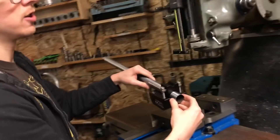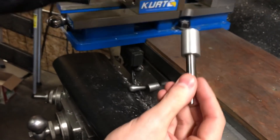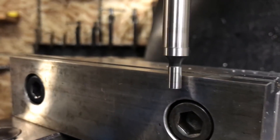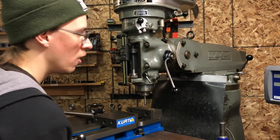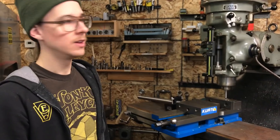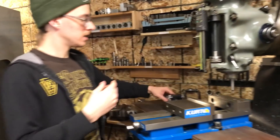If I put it in my machine, I can establish the centerline a couple of ways. My favorite way is to use an edge finder before I load the tube in. Edge finders are real cheap and you can get them for any sort of milling machine. The idea is it lets you establish where this face is in the Y-axis and you can zero off that. When you turn it on it's wiggling around, and as you draw it closer to the edge, it kicks off to the side because of the friction on the tip. Then if you move over point one, you're right above that plane. So now that I have zero established as this back face, all I've got to do is crank off one and a half inches — half of three, the width of this — and I'm on the centerline of the tubing. And I haven't even loaded the tube yet.